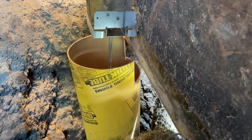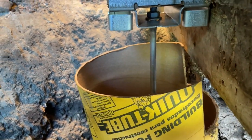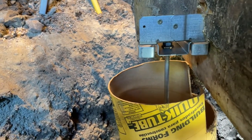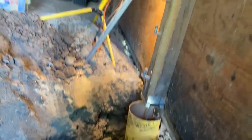When I pour concrete in there, I'm going to lift that tube up, and that notch will hit the bottom of that outside plate and be flat against it to make my form. I'll fill the concrete all the way up to the top, which will be just above the very bottom of that plate, so it'll be resting on the concrete. That'll leave a gap so no moisture gets in.